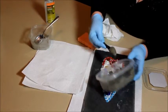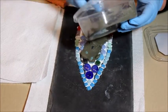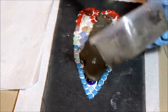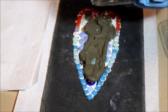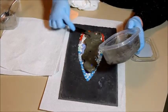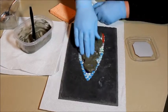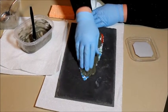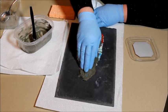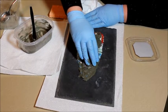We're going to act quickly here and cover the project. I have my gloves on because we want to rub the grout into each of the cracks and make sure that it's deep in there, wherever there's a space between the stones. However far you go on the edge is where it's going to stay, so think about that — some people like to put an edge around the stones.